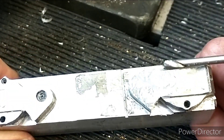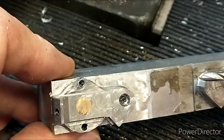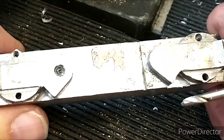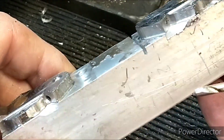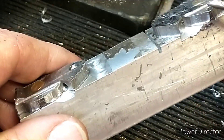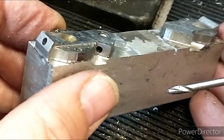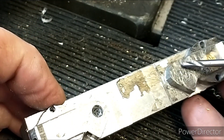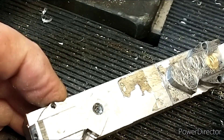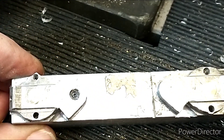As you can probably see, the surface finish isn't fabulous. I was using quite an old cutter because I didn't really think it would actually work successfully - I thought this would be an experiment - because this steel isn't mild steel, it's something quite tough. But what I can do now is get the files out, draw a file and a bit of emery paper, and smooth these curves around a little bit more.